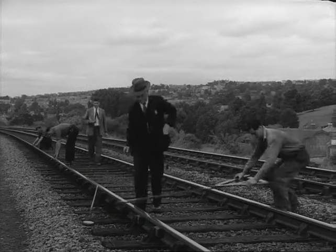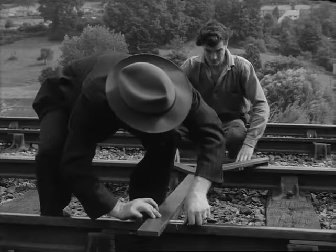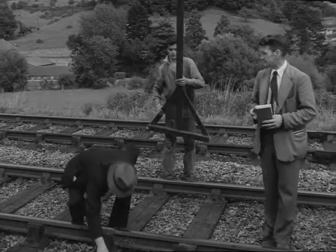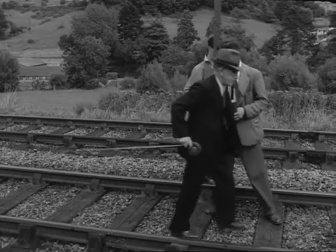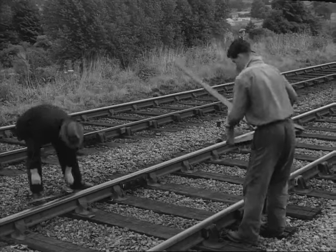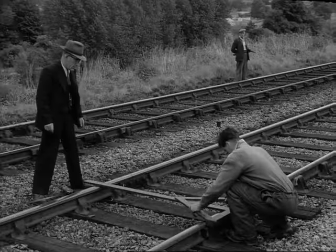On a curve, of course, the inside rail gains a lead over the outside one, and we measure this lead as well as the total lengths of the rails. They're usually 60 foot long. We number each section. And as the wagons of new track will carry six each, I group the old ones in sixes in my notebook.